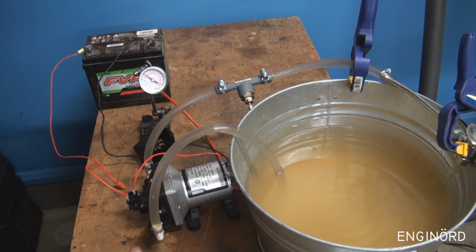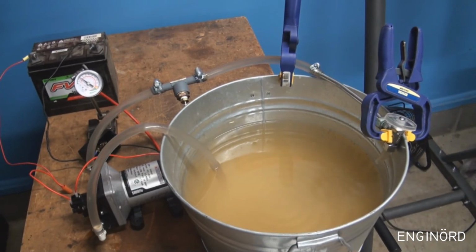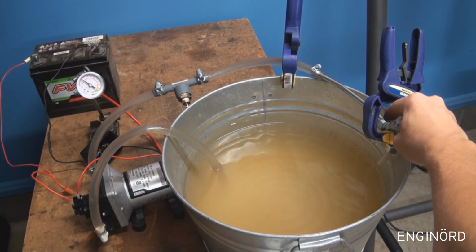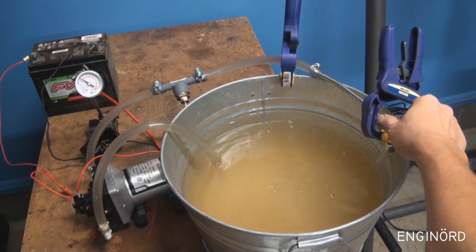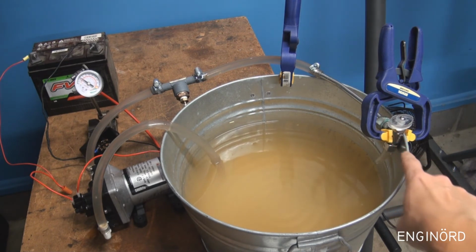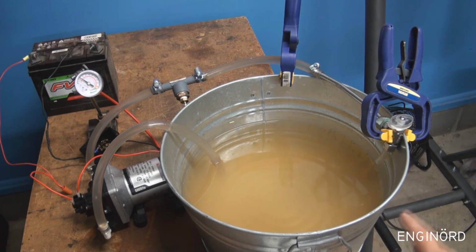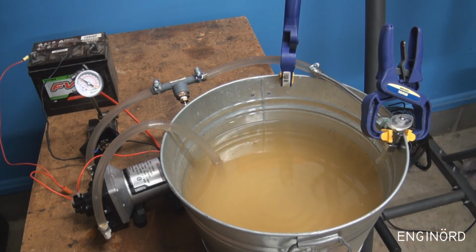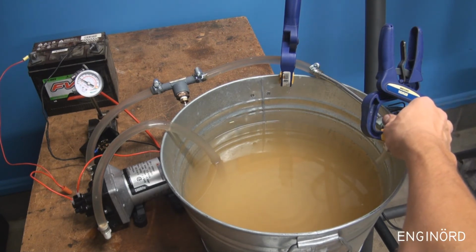Now, if you have this system in your RV and there's a leaky faucet, let's see what happens. So I'm going to go and slowly open the faucet. Okay, so I'm opening the faucet. And as you can see, there's tons of vibration. Now that's due to the fact that this valve, this faucet, has a plunger that closes the channel here. And so when a little bit of water starts to flow, then the pressure drops, the pump kicks in, that increases the pressure, and then it moves that diaphragm in and out. And so that's why there's a vibration.